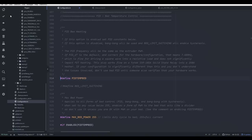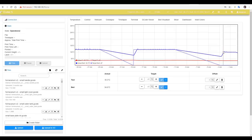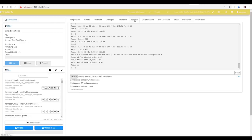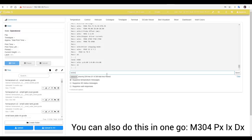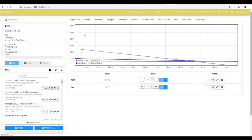A much better solution is to enable PID_TEMP_BED in Marlin. This will use the same algorithm as the firmware uses for the hot end to regulate the temperature. After we compile and upload the firmware, we still need to run a PID autotune for the bed. The gcode for that is M303, C5 for 5 cycles, E-1 for the bed instead of the nozzle, S100 for a temperature of 100 degrees. You can see where this has been performed in my graph in Octoprint, and in the terminal we can see it spat out our PID values. We feed these back into Marlin one at a time: the command is M304 P[value], then M304 I[value], then M304 D[value]. For this to remain persistent we then enter M500 to save our settings to the EEPROM.